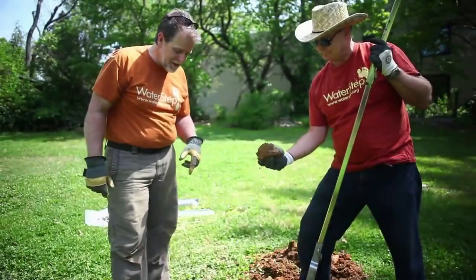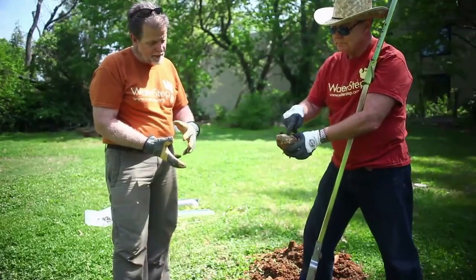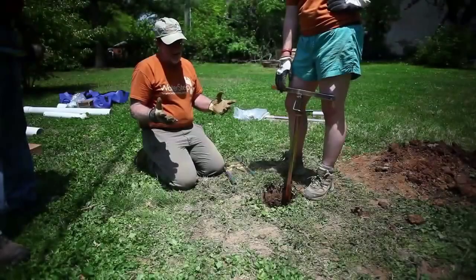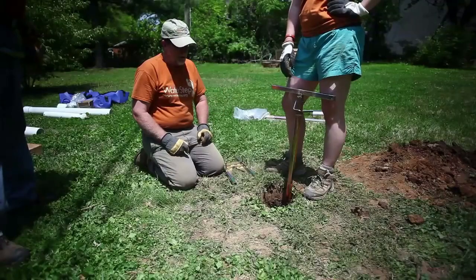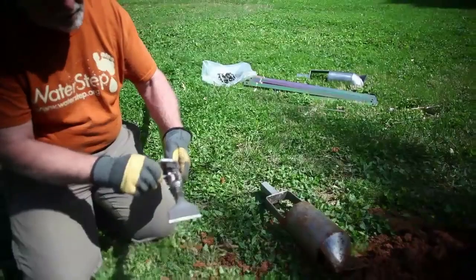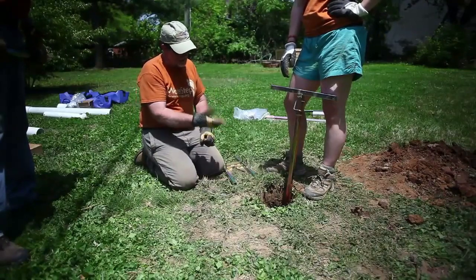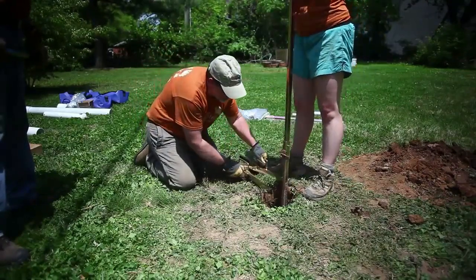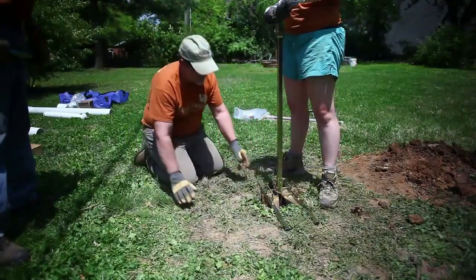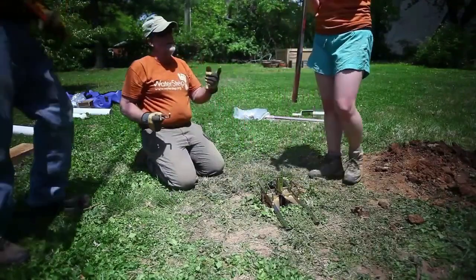It was actually dead center in the hole. We broke it up enough to where the cutter on the bit grabbed hold of it and pulled it right out. We've hit something solid down here — could be bedrock, could be just really compacted gravel. We put the cracking bit on, but the handle's getting a little too low. We're gonna pull it up a length, lock it in, set it back down, take one pin loose, hold everything in place, and add another piece in between.